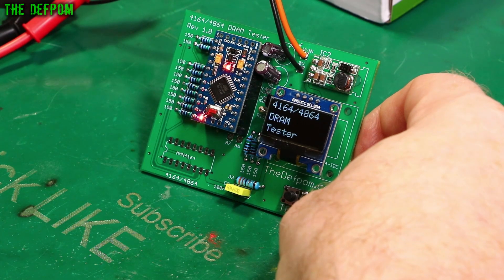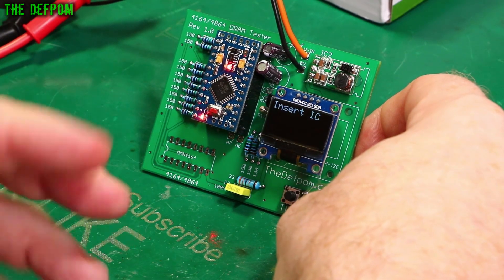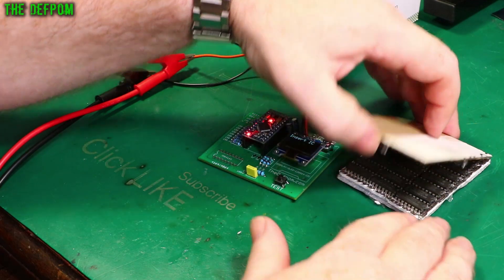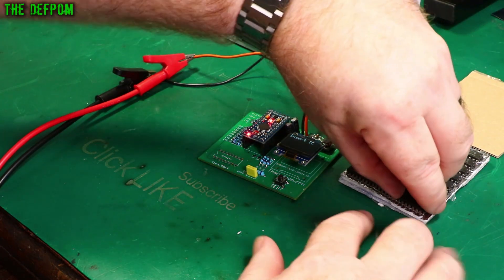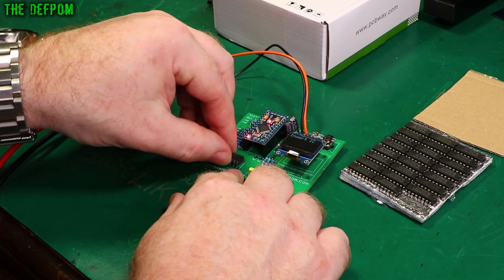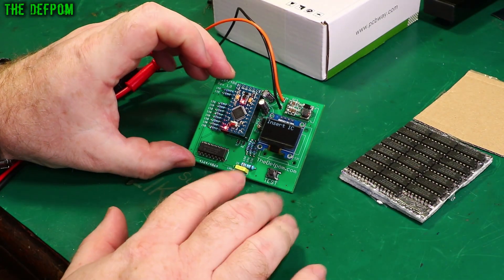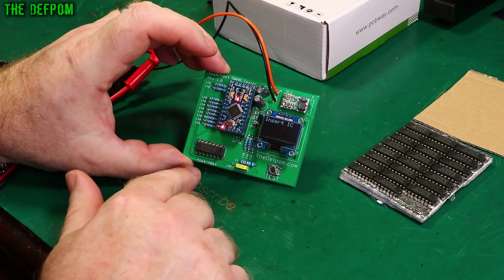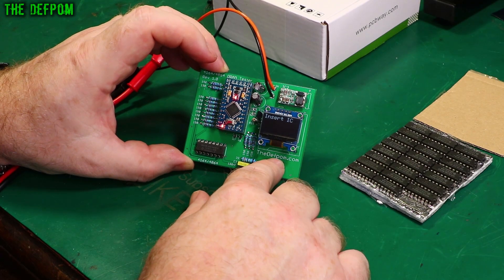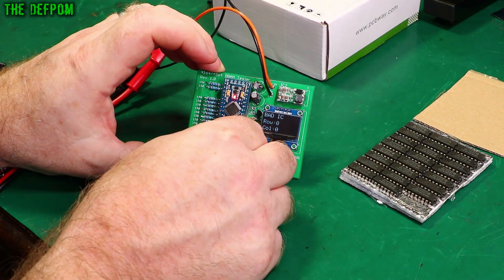Power it up — there we go. If you're seeing any flickering on camera it's purely because of the frame rate; I'm not seeing any flickering here. Let's put a chip in it and see if it actually works. Here are some new old stock DRAM chips which just arrived. I've already verified this particular chip, I believe. It should actually sit in there nicely enough to be tested without a socket. It's safe to do it with it powered up because I've got it switching the outputs on and off, and this transistor is switching off the power to the chip until you do a test. Let's do a test.